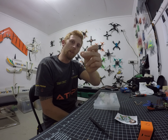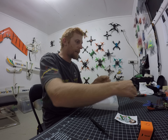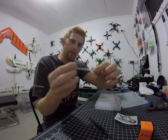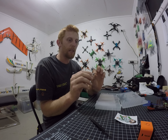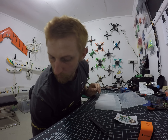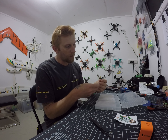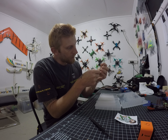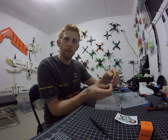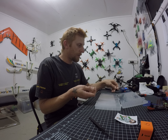I'd say that's a receiver-size tube — that first one looks like it's maybe 1.5mm — it's a great size and perfect for your antenna. Then you keep going up to the next size, which is obviously maybe 3mm now, and it's a really good size as well. Depending on what you want to do, that's the one I slip over my small zip tie. I'll slip that over, and then I can slide my receiver antenna up on the inside — like so. If you don't want to use the smaller one, you can heat shrink it to that and it works out beautifully. They keep jumping up in sizes, so depending on the size zip tie you're using, it works great.